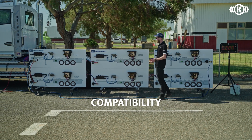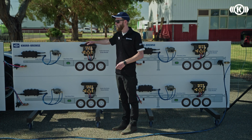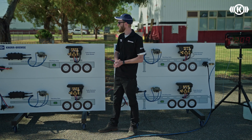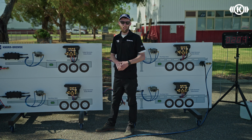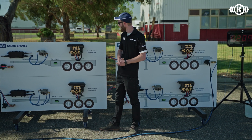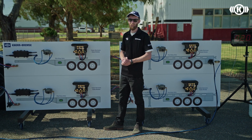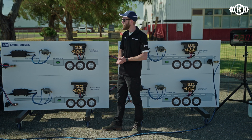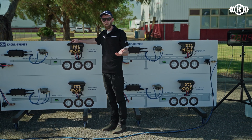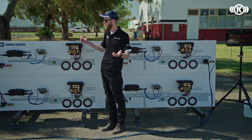We'll have a discussion about the programming within the KB TEBS modules and how that helps compatibility. EBS European prime movers brake totally differently to North American prime movers. EBS trucks are load sensed with different onset characteristics and have the CAN signal as standard. North American prime movers have lower onset pressures, one-to-one braking, no load sensing, and may or may not come with the TRM fitted. So your trailer needs to be set up to tow behind either a North American or an EBS prime mover — which braking parameters do you choose to get the best compatibility through the system?